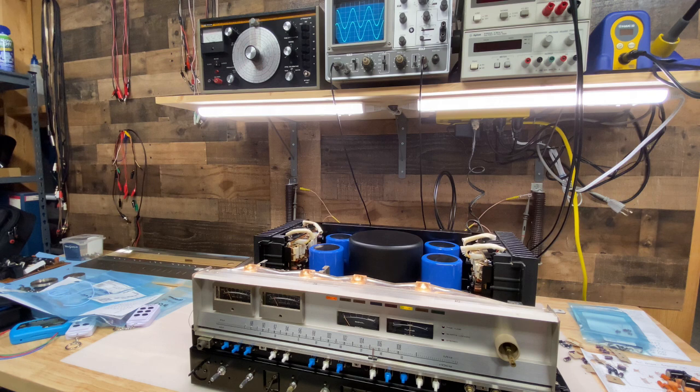That looks good. And since we're at such a high frequency, let's check out the treble controls. That one's working. As is that. And this is a 100 hertz sine wave, so let's check out the bass controls. That one's working. As is this one. That's great. This is all checking out pretty good so far, so let's move on to the rest of these boards here.